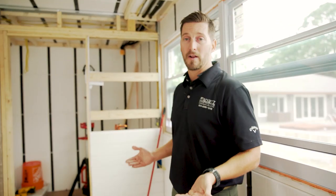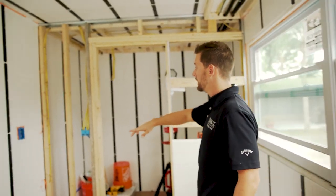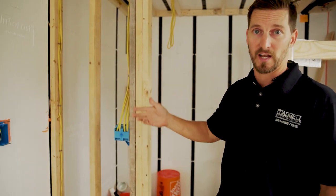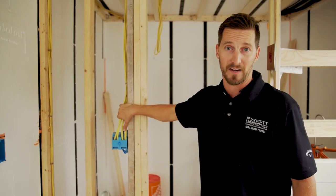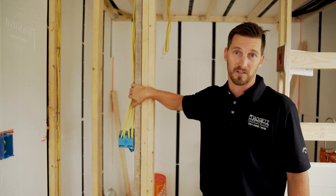Where I didn't need to run wire through InSoFast and could put it down walls, this was nice and fast — quick and easy. This is just like residential framing where I have one, two, three, four sleeves of Romex running through here. There's no way I'd be making this go through that InSoFast — I'd have to cut out the whole strip going all the way down, then get to one box and branch off to another location.